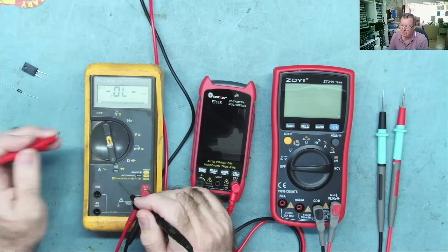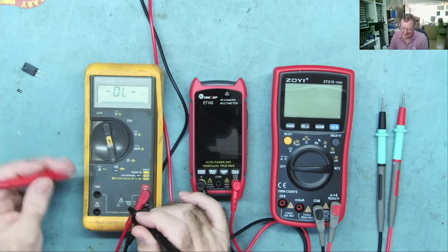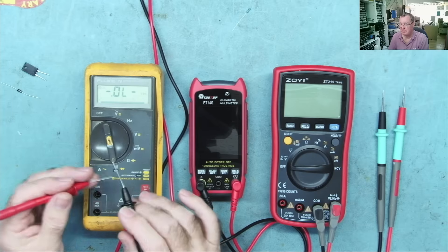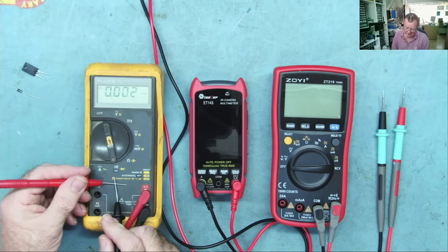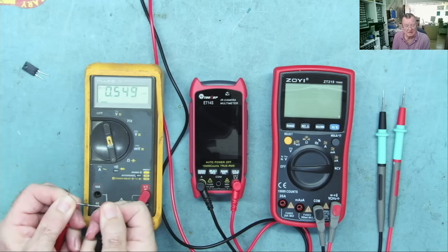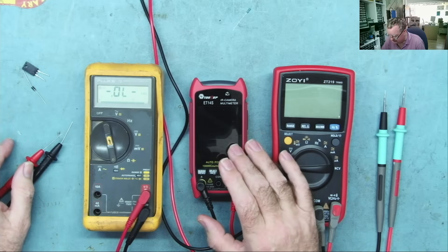The reason we want this is when you're probing around on a PCB, looking to see what connects to where, trying to work out how things are connected when fault finding. If you go across a transistor and you can see the semiconductor junctions, you know it's good — you get the bleep. Continuous bleep on a short tells you straight away there's a short on that transistor or something connected to it. If you don't get the bleep you have to look at the multimeter — is it open, is it short? That is an essential feature for fault finding and I would not use a multimeter without it when tracing around PCBs.